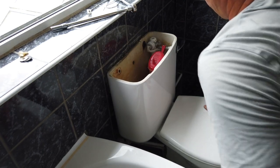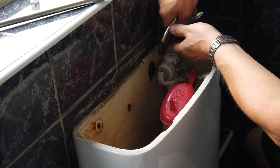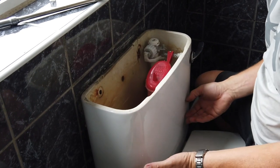The main part here is held on with these butterflies that go through to the stainless steel fixings in the system itself, so we'll crack these off. They go all the way through from there through to the inside — you can see those 10mm fixings at the bottom. So we go from that down to that. These are good because they're stainless — the threads are nice and clean. We've undone those two wing nuts. Now we've got this horrible rusty one — it was completely rusted and fell off. I'll just get a pair of mole grips on it — there it is, just came straight off. Look how rusty that is! So now this is all free and should lift straight off the top.